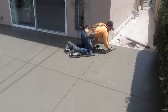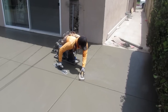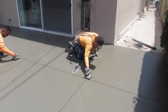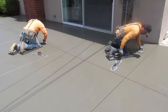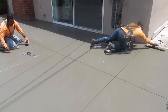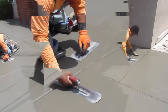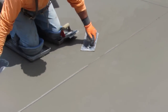This is basic broom, jointed normal, and it's still just got that West Coast touch to it. Look at that. I could stare at that all day. See, they're retooling them out. They just put the hand joiner in their sliders as they go. And then when he's going to hit the joints, he'll pull it back out. They just put it under their leg. Milton's probably got one on him too. Little scrubbing, not much. And then seal it up with a steel trowel, and you can get it real crispy. You can get the best look on it.